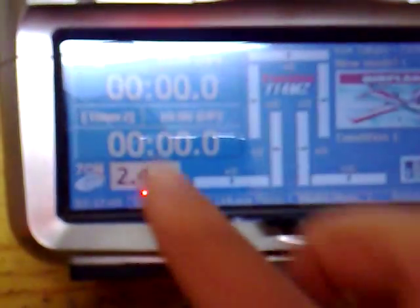You can actually hear the faster speed of reaction between the transmitter and the receiver in this mode. Now, some analog servos really do not like this mode and would only buzz and not work. So if you get one and you see a servo buzz, you should know that this is due to the high speed mode.